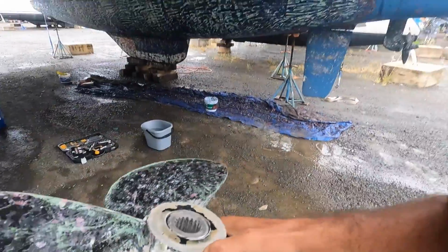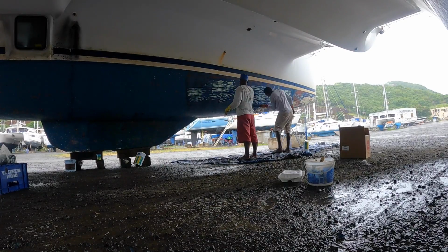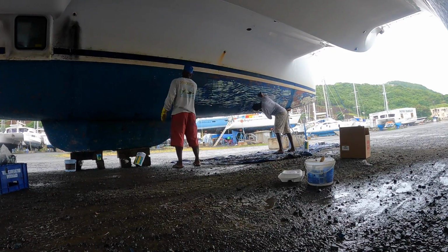And yeah, we'll see, guys. You know, when you haul out, it's full of surprises. We didn't know we needed to do the bearings on the rudders too. We're gonna do that. They're gonna come dig a hole under the rudder so we can lower it. I'm gonna try to drain the oil on the sail drives so we can remove the cone clutch. Man, oh man, surprises. That happens mostly with haul outs. As we're hauled out, we find 2 unpleasant surprises on our boat. You know what they say, boat stands for bring out another 1,000.